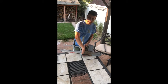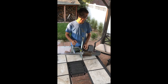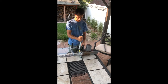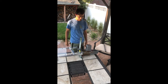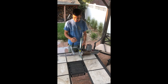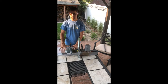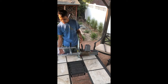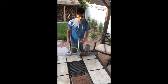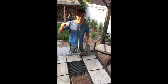Although I lose my teeth that I had here to grab and walk it along, it would grab and leverage right into the wood, which is nice. But now you got a handle out here, and you can push and pull. I was concerned how well this was gonna hook on. Boy, it bites right in really good to the bar. No problem there. So, a little bit of wobbly here, but I think that stays parallel. Yeah, the body moves, but the plexiglass surface that's gonna slide on the log and the bar seem to stay parallel. So don't worry too much if this is hanging up and down and swinging. It's locked this U in, so it should make a nice even cut all the way down. I'm excited, let's give it a try.